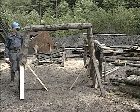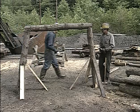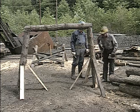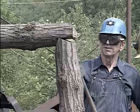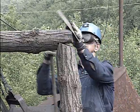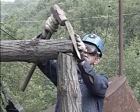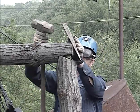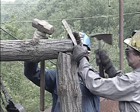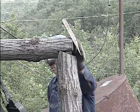Now the small flat surfaces that Buzzy put on top of the collar when he made the notches are going to serve a very useful purpose, as they're going to portray now. That flat surface affords a very smooth area for that wedge to be driven in to tighten that collar tight against the rib. This way, when you apply pressure to that wedge, the wedge has a flat surface to ride on and it doesn't break the wedge.